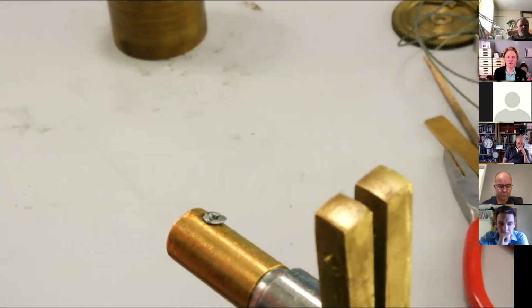They can't, unfortunately. It's dangerous to remove them by hand, and it tends to distort them. Now, it's not the end of the world if they get distorted. People, again, you know, disaster scenario. But I would say no. If you haven't got a mainspring winder, just leave the mainspring in the barrel unless it's actively rusted.